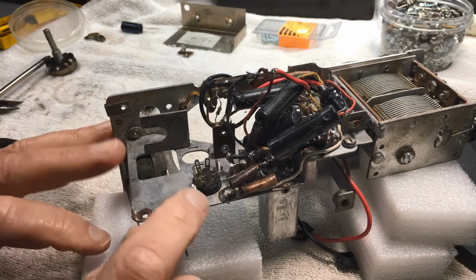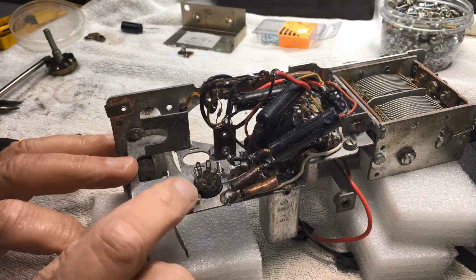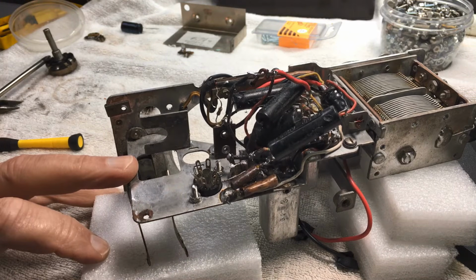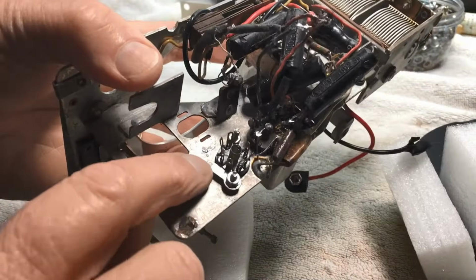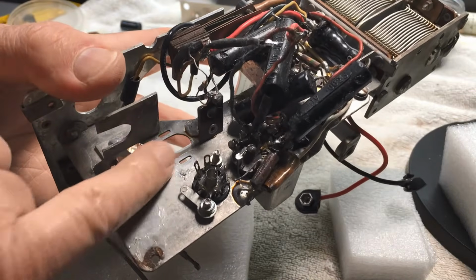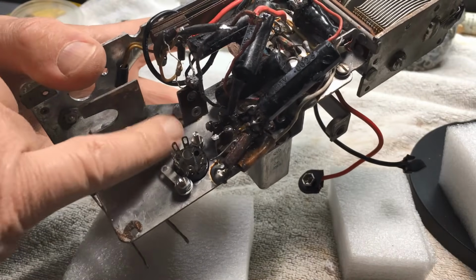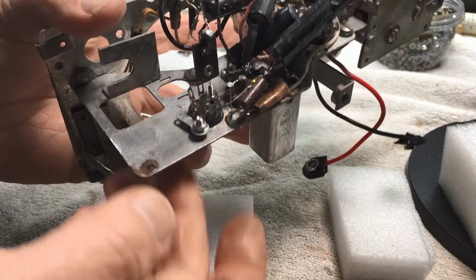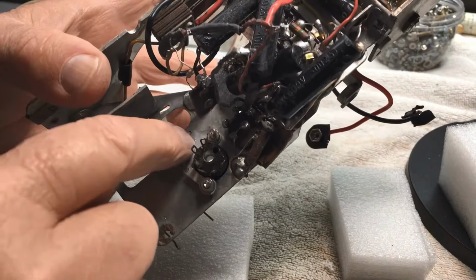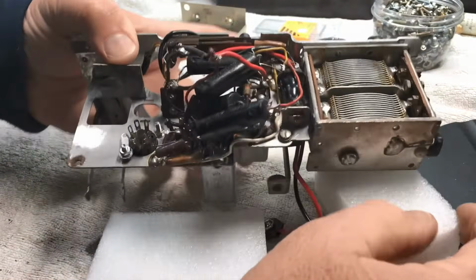I'm just using a transistor, an old style transistor collector tab that we used to put on the trannies, or sort of an earth lug. And there he is, just a little lug, just to make soldering easier, so that you're not soldering onto the chassis. I think I can fit the capacitor just in here, or maybe on top. Haven't worked that one out yet. Maybe on top with a little strap over him. We've got the 2 tie points there, so yeah, we'll have a look at him shortly.